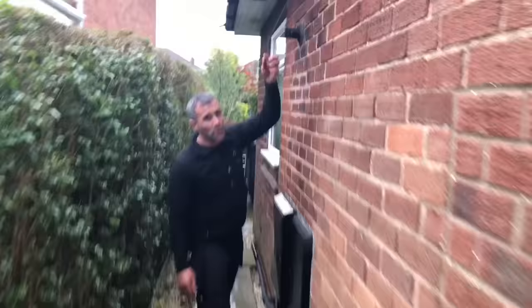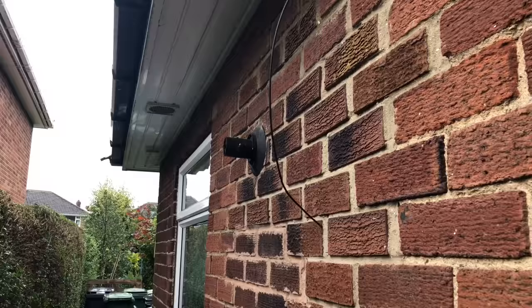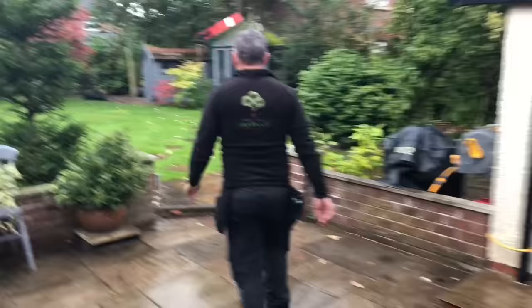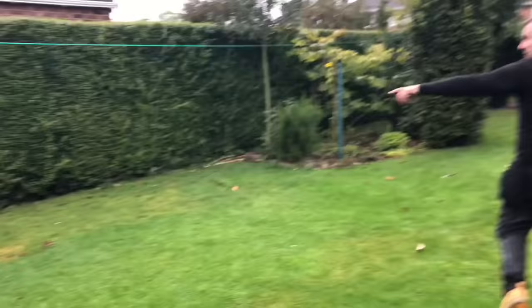So, power and internet. The customer has already run us a Cat 5 cable there through his eaves from his modem. So it's actually a draw wire, so he's going to pull that. There is his electricity. So both our cables will run down that wall. We'll lift a flag. We'll drop into the gravel path there, and we'll shoot straight down there. We'll bring our steel wired armoured, which will be 10 mil, and our Cat 5 cable straight down there towards where the garden room's going to go. If you follow me, I'll show you. It'll carry on down there through the hedges. It'll work its way along here.